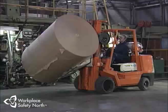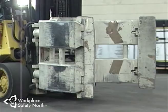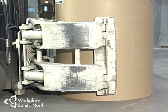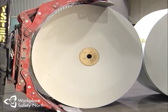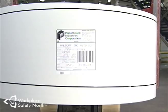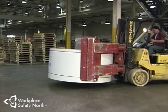These powerful units can pick up paper rolls weighing in excess of 3,000 pounds and move them with ease. There are two ways a clamp truck is used to pick up paper rolls. The first is to rotate the clamp and carefully pick up the paper roll in the vertical position. The second way is the horizontal or bilge position: with the short arm of the clamp tilted downward, the operator eases the truck forward, clamps the roll, and raises it. The roll is then rotated to the vertical position before moving, ensuring that the load is stable and no undue stress is placed on the short clamp arm. More importantly, it prevents the danger of a runaway roll if the load is accidentally dropped.